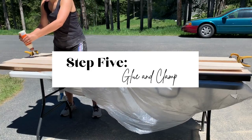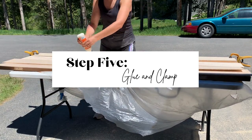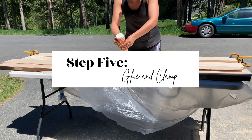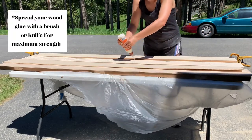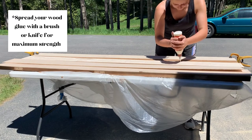Step five is to start gluing. I used a quicker drying wood glue because the wait times on this project are honestly the worst part. I initially used clamps and weights to clamp down the wood while it dried, and then my smart helper friend showed me how to use painter's tape as a clamp — it's a lot more wasteful, but way more efficient. You could also use brad nails around the border of your door for a more secure fastening. This was a concern I saw a lot on my Instagram, that this would pull up.